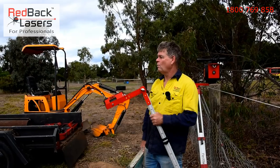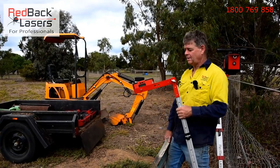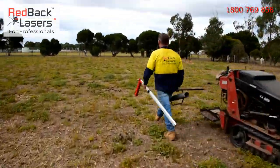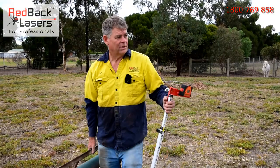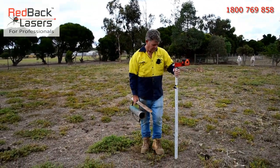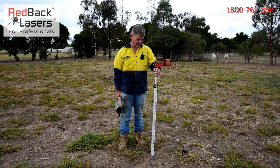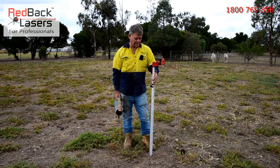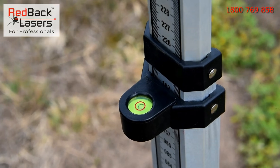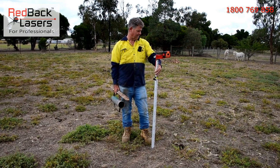Our fence here is about 50 metres long. We want to put another subdividing fence down at 25 metres and some gates either side. The very first post I want to mark out is the centre post, so I've got to pace in 25 metres. So we've paced out our 25 metres — there's our laser somewhere in that vicinity. Now if we pick up our laser beam, it says we're about 3mm out. There's a bullseye vial on the back of the staff and I want to get that correct. Here we can use the millimetre receiver — about 23mm out, 10mm out.